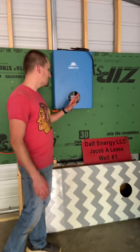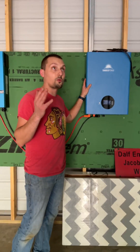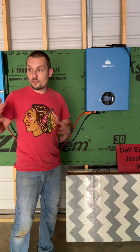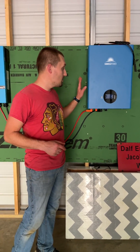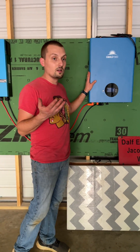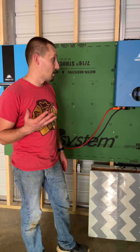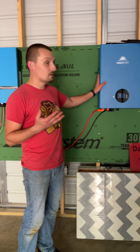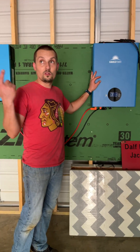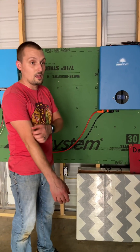One learning lesson: we bought just the one battery. On days like this, over 1,000 watts with our four 370-watt panels, it'll power everything we need. But it's December, and we only get good sun from 10 to 3 — about 5 to 6 hours a day at max. The sun's not really all that strong in wintertime, so I knew this was going to be tight, and we ran out of battery this morning at 5 a.m. Got power back again around 10 a.m. when the sun kicked back to about 1,000 watts immediately.